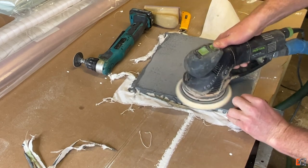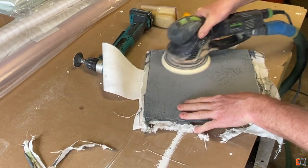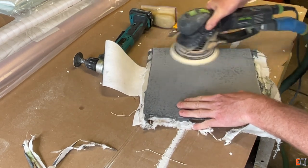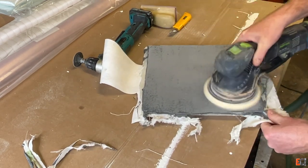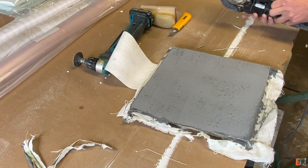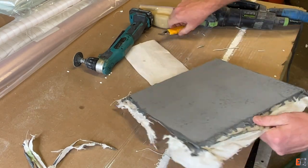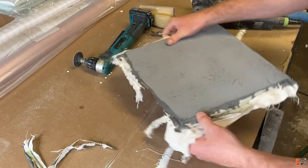If I were going to paint this with a two-part paint or really anything, I just need to work this to a very nice surface, probably apply another round of primer to make it very nice and fill any pinholes. I just wanted to show how to build out a surface that you could work to paint from.